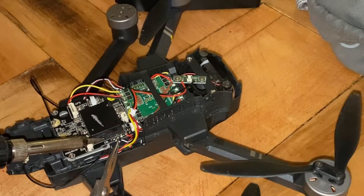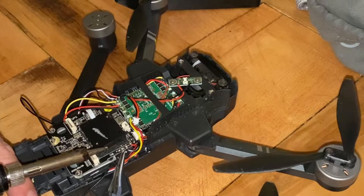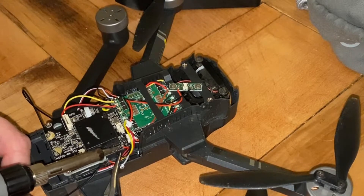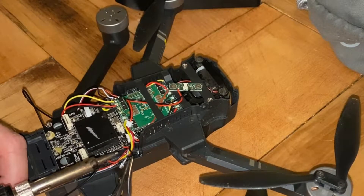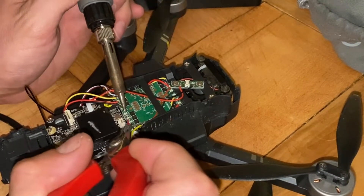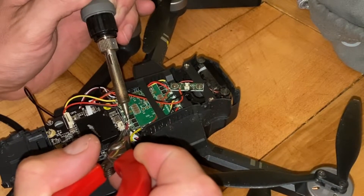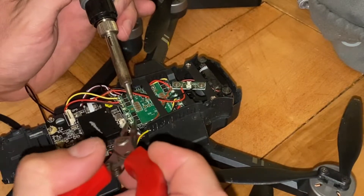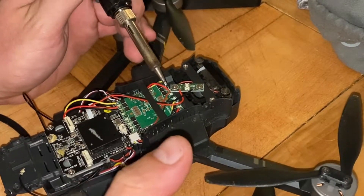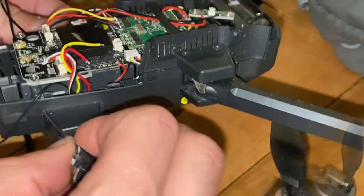For this step — taking the wires off of the circuit board — you need a soldering iron, some needle nose pliers, and some patience. I would also recommend taking a picture of your wires so you know exactly where they go, so when you put them back they go in the same spot. What he's doing here is heating the solder that's there currently and then pulling the wire out. Once all those wires are pulled — we've got this last one right here — you just work the wires along the edge and pull it out the side.